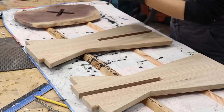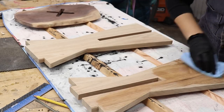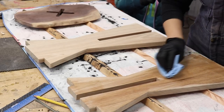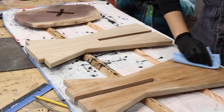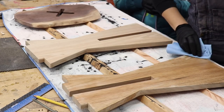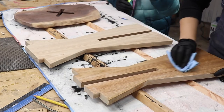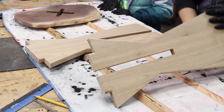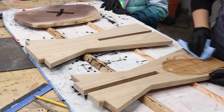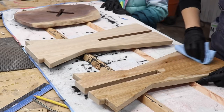I sanded everything up to 220 and just eased off all the edges. Now I'm going to finish it with some oil and wax finish. My kids literally just came off the bus and I started this project at maybe 12 o'clock this afternoon, filming the whole time. So this project really does not take a long time to make — just an afternoon — and it makes it so much simpler with the templates. If you have to do a glue up, that would make it take longer because you have to wait for the glue to dry.